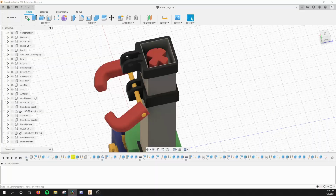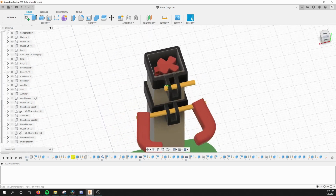Attached to the rings are extrusions on one side, like little jutty out points. The extrusion, or jut, has a hole running through it that acts as a pivot point for the two mechanisms, because they're both basically just rotation. And through that hole runs a D-shaft that transfers torque across the shaft into the mechanisms from the servo drives.